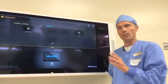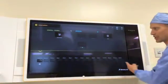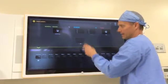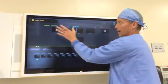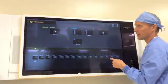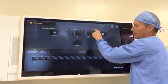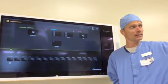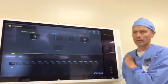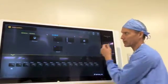This essentially is a video router. All the monitors in the room you'll see down at the bottom here, where they're going to populate. All of these destinations here — we can take whatever is above the yellow line and drop it down into these different slots as destinations. Everything up here has the ability to go down to one of the monitors, and most importantly are the sources, which are plugged in through the equipment room behind us. If you plug in a monitor and don't see it populate, we have a refresh button right here, and then you should see the box pop up with whatever you added into the sources.